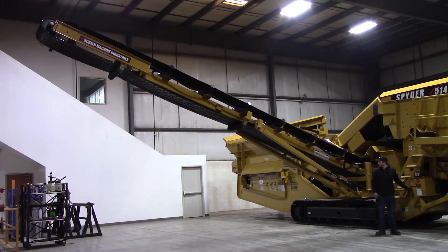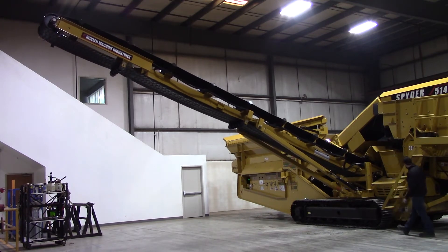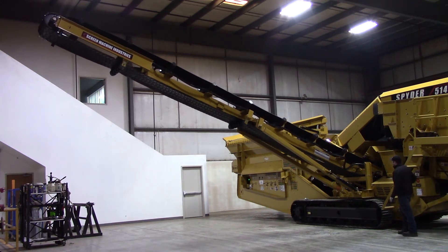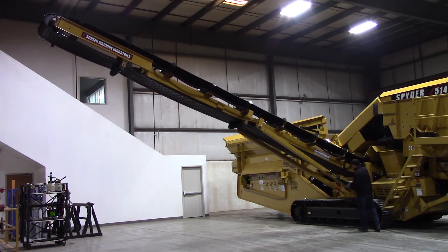Take the handles and just bump them up a little bit for both cylinders. The two handles you'll be working here are your large mids, or the two cylinders right in the front here. So you can see I went up a little bit with it, just to loosen these pins up so I can get that pin out. I'm going to set that one aside. This one's nice and loose now too. Take that out, take that pin too. Now that you've got both pins removed, you're ready to start swiveling it over towards the machine.